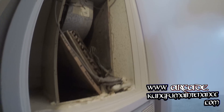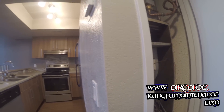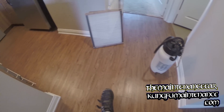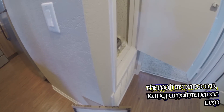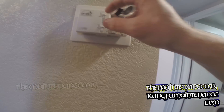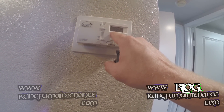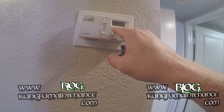I'll change it out with a new filter and you'll be back in business. I went and got my new filter, got my coil cleaner, and I'm going to go to town on this puppy. I'm going to go ahead and turn it over to cooling because we want the coolant to run while we clean the coil.